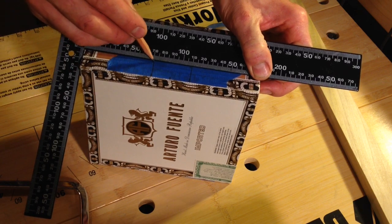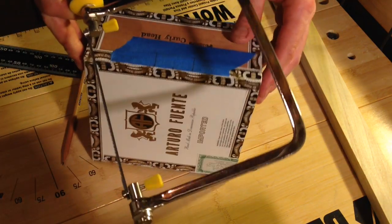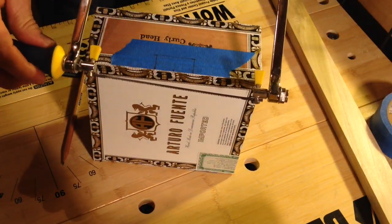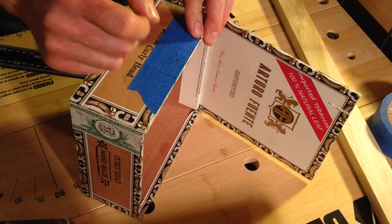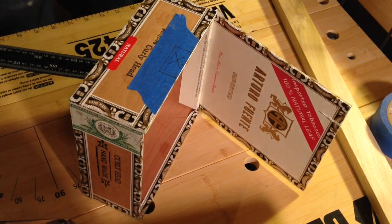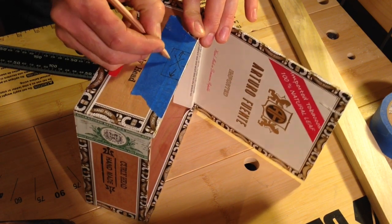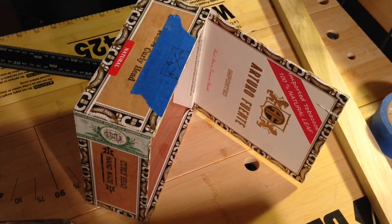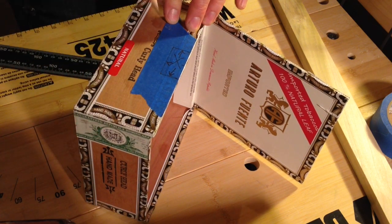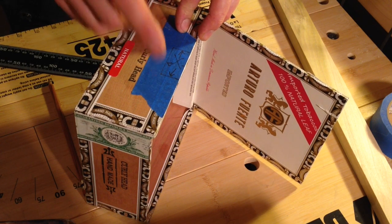It would be great if I had a saber saw or a jigsaw, which I do. But to show you that you really don't even need that expensive power tool — it's easily done with a coping saw. Now, I want to cut to the inside of these lines. I don't want to cut to the outside. The reason being, it's kind of like cutting hair — after I take it off, I can't put it back on. So I want to cut to the inside of the lines, and I can use a file or a piece of sandpaper to finish out the hole for a nice snug fit on the neck.